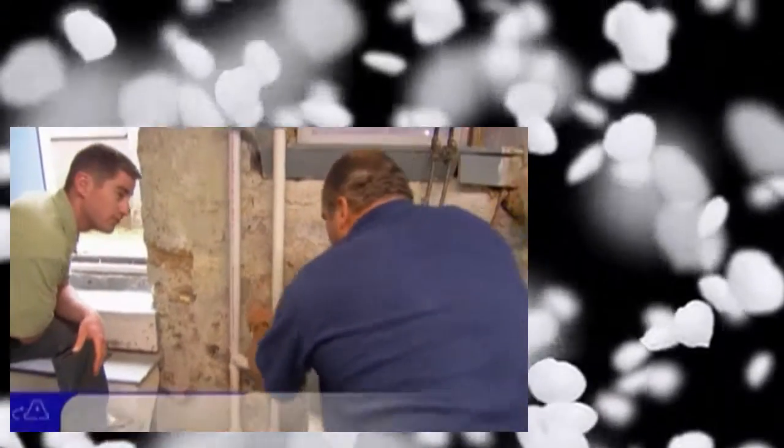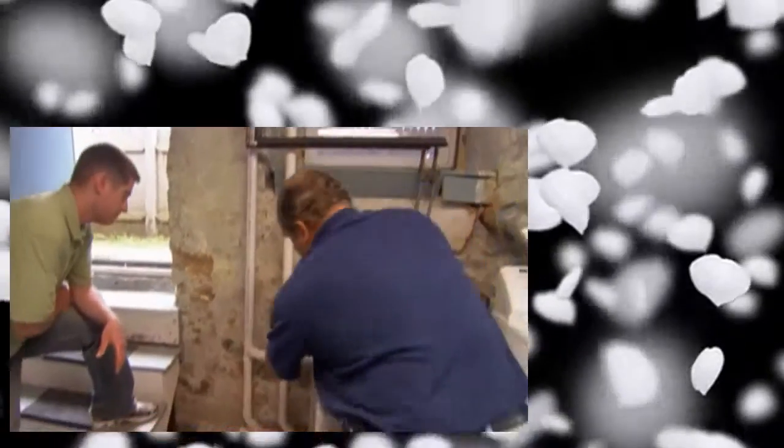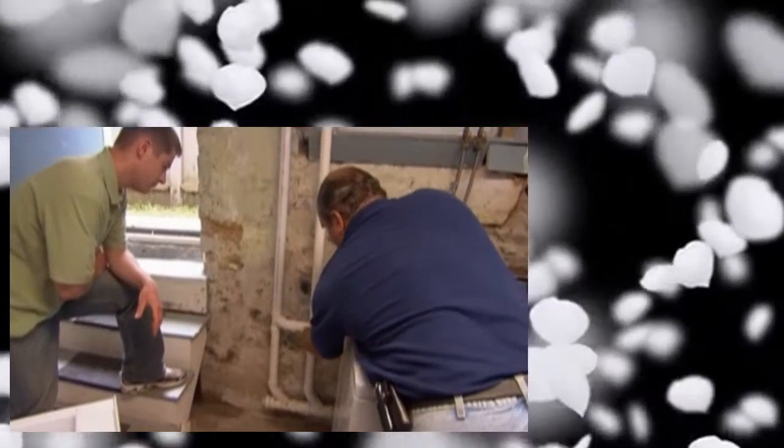That's a really good thing - we often don't see this in basement applications. What's a vent for? Well, without that vent this drain would gurgle. What happens is it breaks the vacuum so that water will go down the drain. So it's a really good thing that it's there.